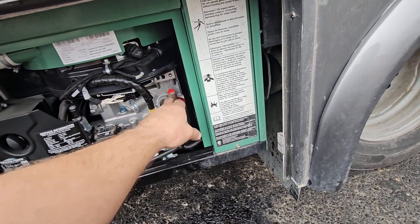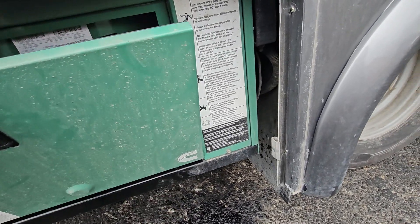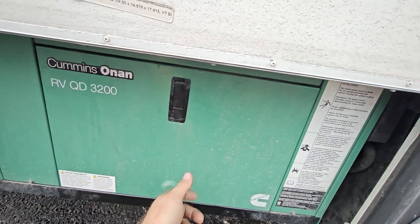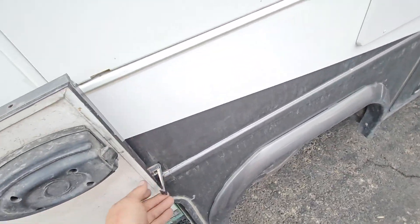This is your oil fill and this is your oil level check. The bottom metal fitting is a 22 millimeter — you're going to unscrew that and it should drain through the bottom. Wipe it up; it makes kind of a mess in the pan, it took me a while to clean it up, so just have some towels ready. Unscrew that 22 millimeter, it'll drain out the bottom. Pretty simple — same as an oil change. 1.1 quarts. All the specs are right there on the generator.